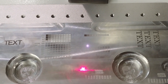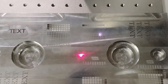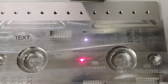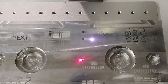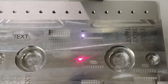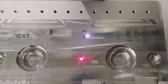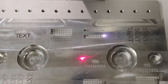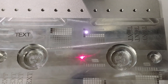In the bottom right of the screen you can see my original 20-watt laser marking. The text marks in the top right corner and bottom left corner are also done by my 20-watt laser. The top left text mark was done by this 30-watt laser at 300 millimeters per second. The one in the center bottom is also the 30-watt. The big difference I see looking at this grid is that the dark marks really come around 60 percent power instead of 40 percent power on my 20-watt.